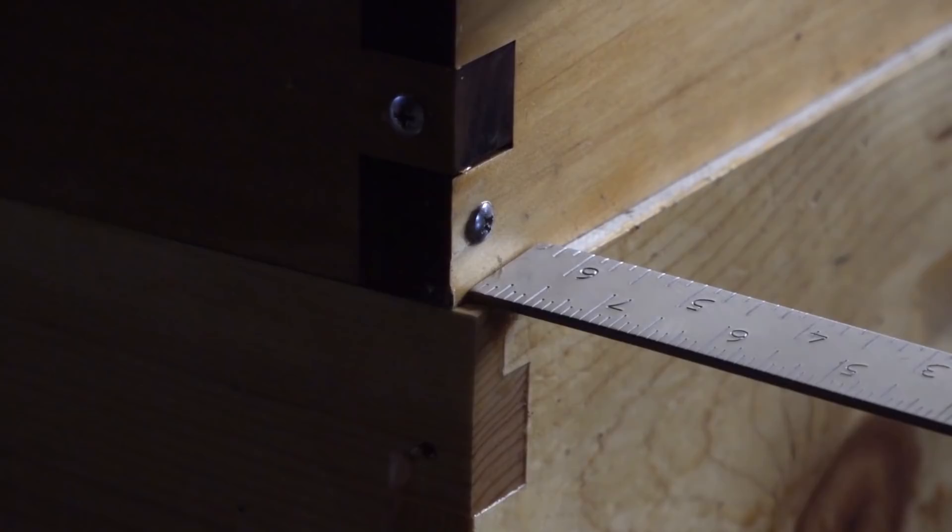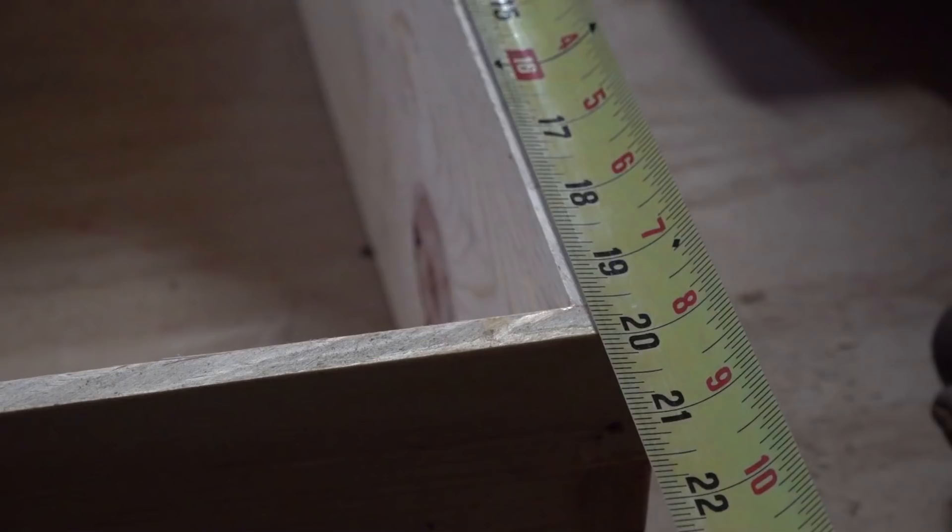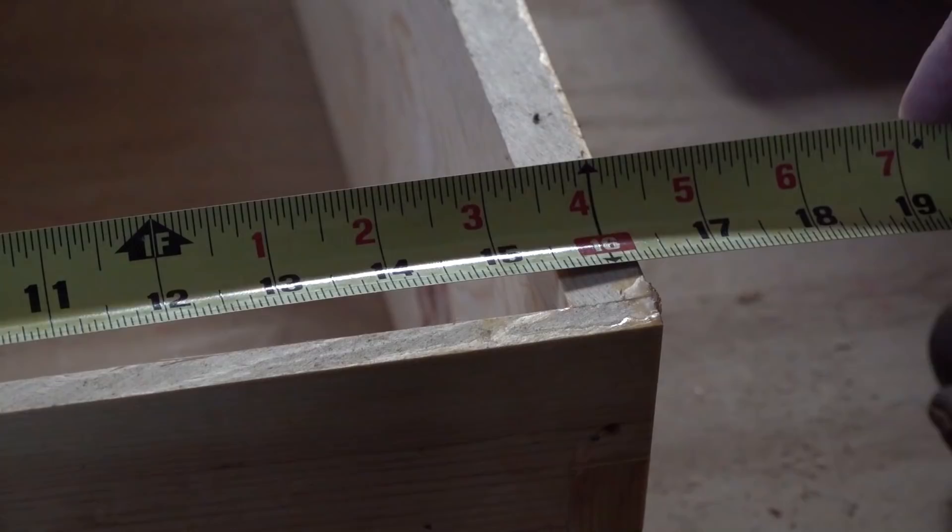Comparing the dimensions, it's a little larger than the Flow Hive 10-frame — larger by about a quarter of an inch. So if you're making this shim for a Flow Hive you're going to want to cut that quarter inch down. Just measure your box and go with the outside dimensions: 16 inches a little over in width here, and they're all 20 inches long.